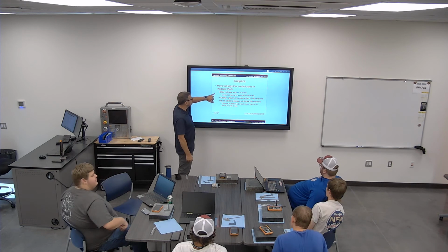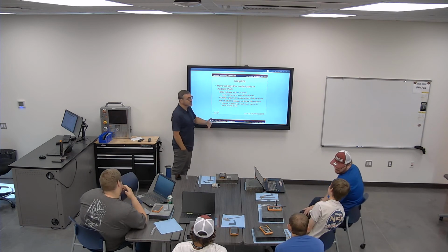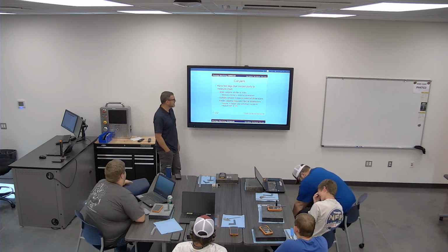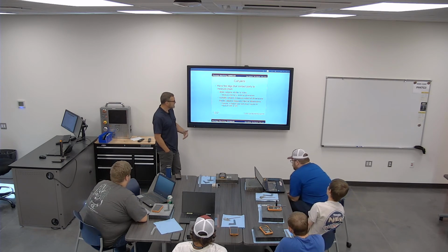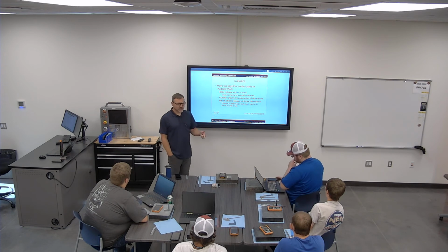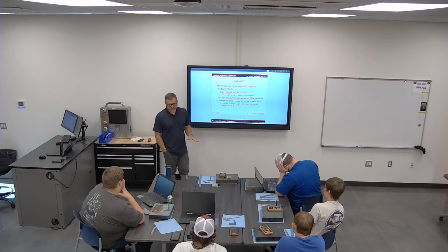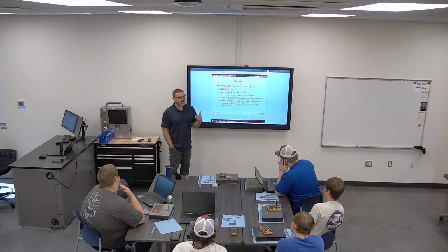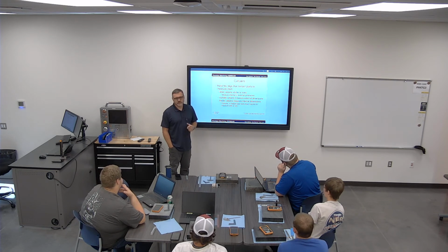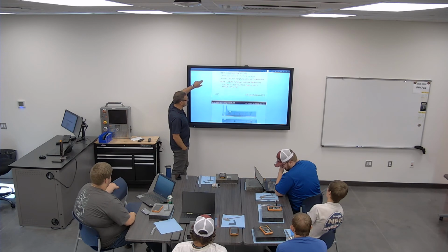Okay. All right. So we've got a couple different tools that we use pretty early on. Slide calipers, or dial calipers, is probably one of our primary tools. They have outside measurements, inside measurements, and step and depth. We have spring calipers. Those are transfer tools. You'll use those in metrology, but you won't use those really anywhere else. So we use those in that classroom. I have personally used spring calipers probably 5 times in my life outside of the classroom. A dial caliper or a telescoping gauge is probably my primary tool for those types of things.